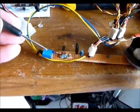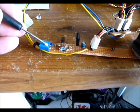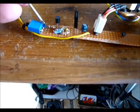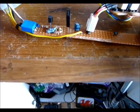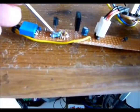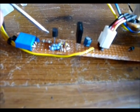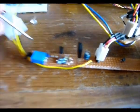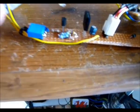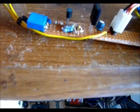Here's the circuit. I've got a potentiometer here - a 0.5 watt potentiometer wired in rheostat mode. That basically means I've got a line coming in and the bottom two pins are joined together, so as I adjust the pot I get a single resistance across there. The potentiometer is protected with a couple of 620 ohm resistors making 310 ohms, so this can go from 310 to 5,310 ohms.